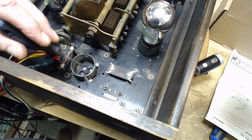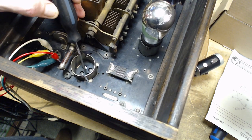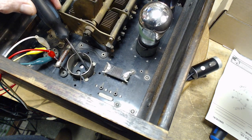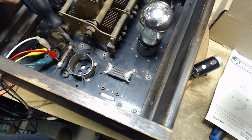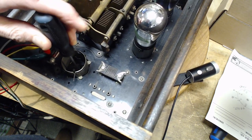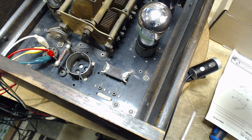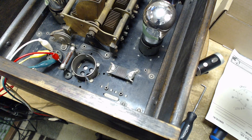For cleaning them — how would you ever clean something like that? We all know from bending metal you need to bend it past where you want it to be. You have to bend it enough that you're straining the metal — stress and strain. Stress a metal, when you let go, it springs back. Strain a piece of metal, and when you let go, it does not come back to the way it was.